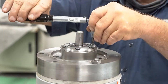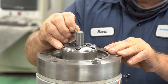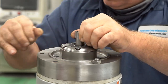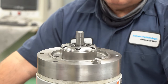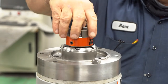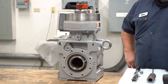After the bolts are torqued properly, the last thing to do is put the key back and the coupling back onto the shaft. One last step is to verify that the shaft rotating direction is correct. It should freewheel in one direction only, and that direction should be the opposite of how we started. This is the overall reversal process of the integral backstop.